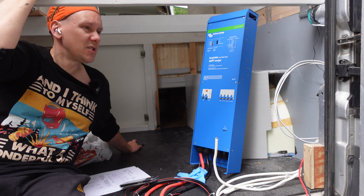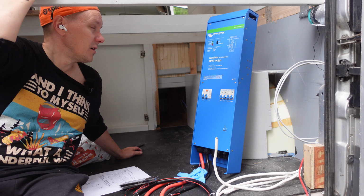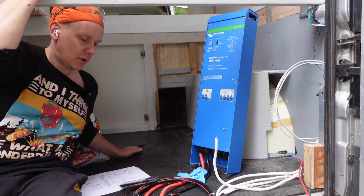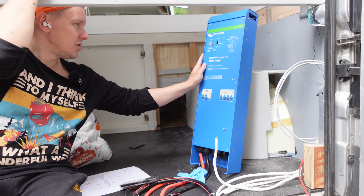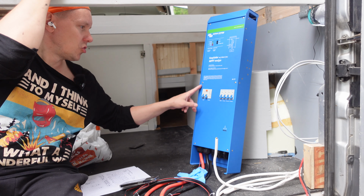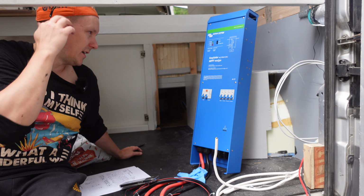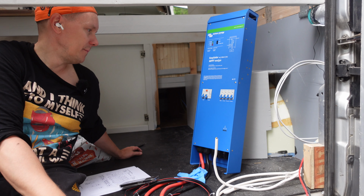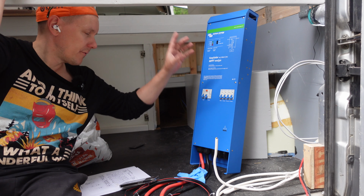We planned to install this inductive stove because we are not having the gas system. So we might need to be a little bit picky on that one because those are like 1600 watt. So yes, what this is, it's a combination of solar charge controller, charger, fuse box. It has like everything inside of it, and it has some sort of intelligence inside of it also, so it controls stuff wisely, hopefully. So in here goes solar power, like from the panels.